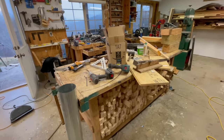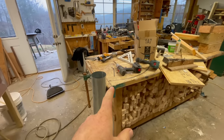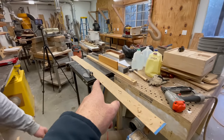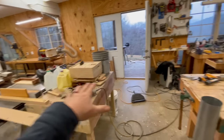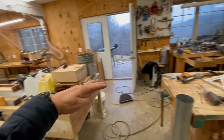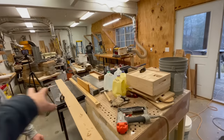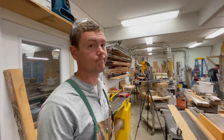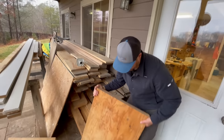If you're building your own workshop, here's one important thing: all of these tables are the same height. We chose the height based on the table saw deck height — 35 inches. That way the workspace is essentially flat, and your boards can slide across any of these tables without getting hung up. That's a really important thing when building your own workshop.